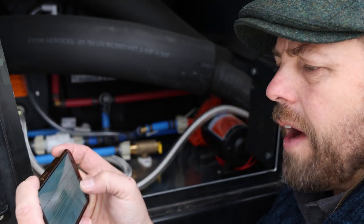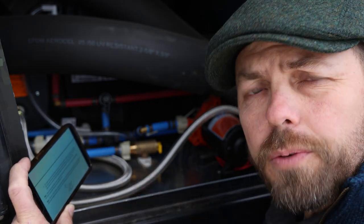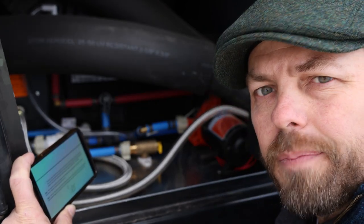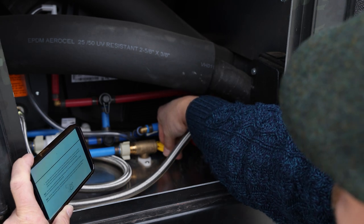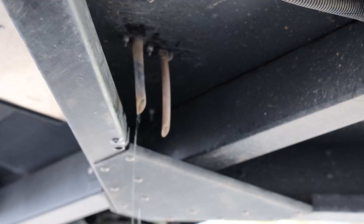Moving on to step five and six, if you'd like to capture the water from the Truma combi water heater tank, then you would place a vessel or bucket, whatever, underneath, basically right here. There's a little hose underneath the trailer that the water will drain out of. And then in step six, you want to find this yellow handle right here and pull that out. When you do, you will see water draining underneath the trailer. So you'll want to wait for the Truma to completely drain.